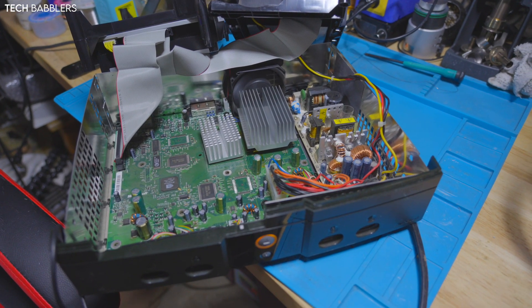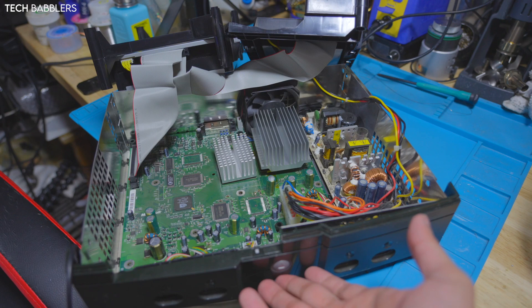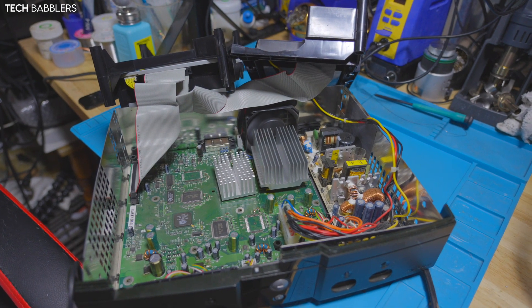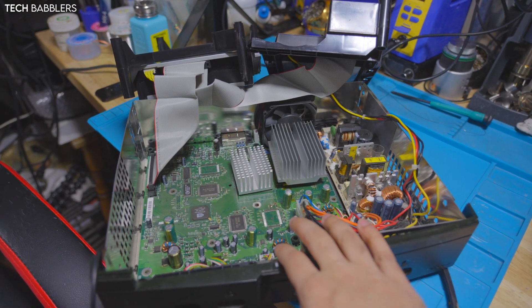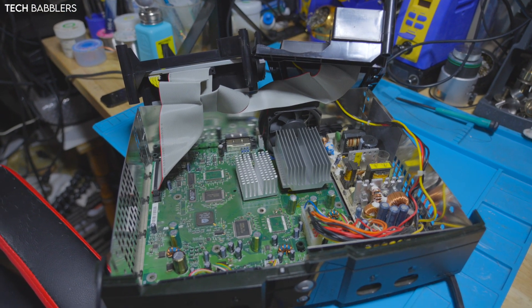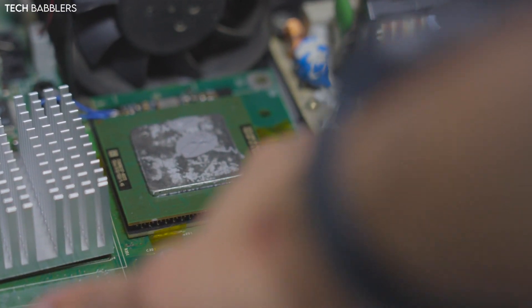Oh no. If you see that, it's fragging — which means something in the process went wrong. What it is, I can't tell you. Not good. I don't know what to do from here with this one. I do have another motherboard, so what I'm thinking is leaving this one alone for now and starting fresh on that one. There are a lot of moving variables — it could be the CPU, could be the interposer, could be one of the balls beneath, or a connection between the interposer and the pins.